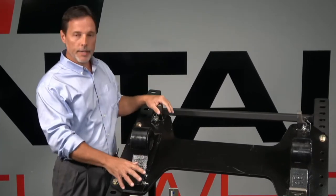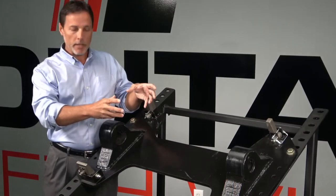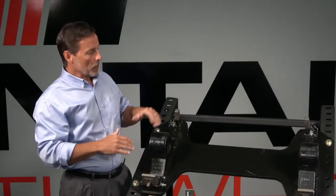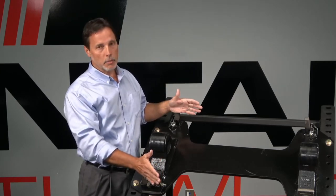The other side of that is if you're connected and going on road, especially over rough and uneven terrain, it's also important that you put the blocks down so that you're not blocking the fifth wheel from articulating. What can happen is that as your trailer and tractor come to different angles on different terrain, the kingpin of the trailer can actually pull up into the fifth wheel and put pressure on the front and rear of your fifth wheel. That will be excessive pressure that can cause deformation and cracking of the skirt of the fifth wheel around the blocks if you're leaving the blocks up.